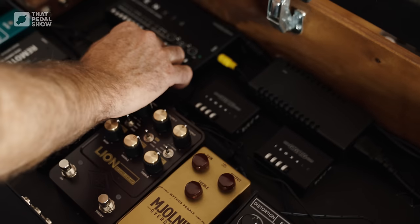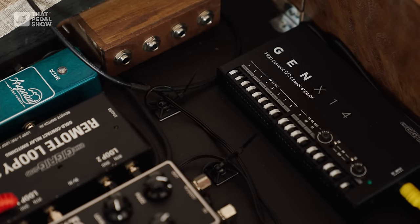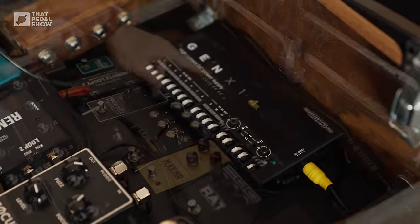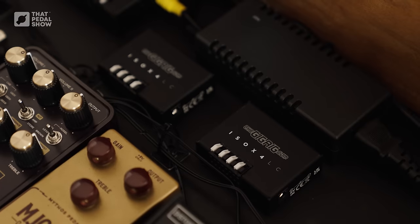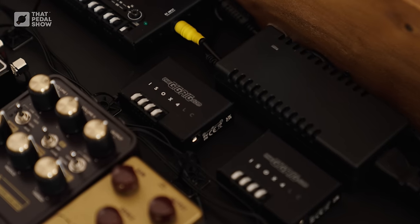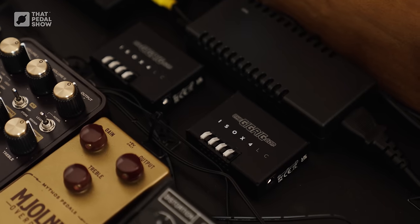Obviously, you can see here as well, started to lay out all the stuff for the power. So the way I like to do it, so we have these little standoffs here. I know you'll see loads of boards where they have standoffs all the way along, and that's really cool. The problem comes when you want to change something. The way that I've done this and the way I like to do the boards generally is have enough standoffs to make it look really neat, but not enough to make it impossible if you want to change something.